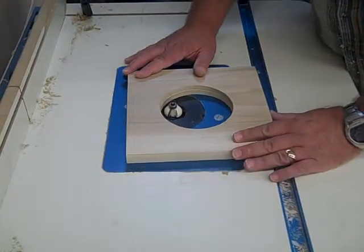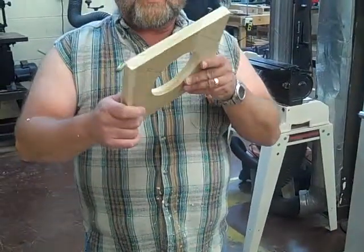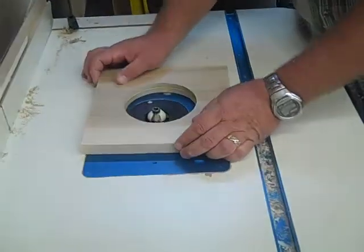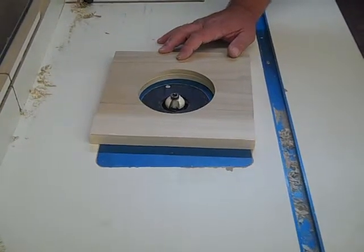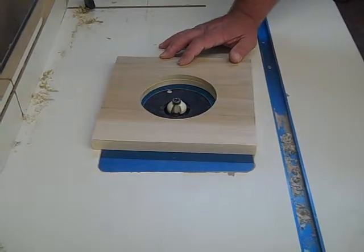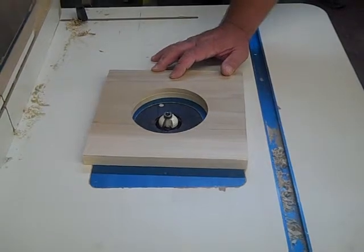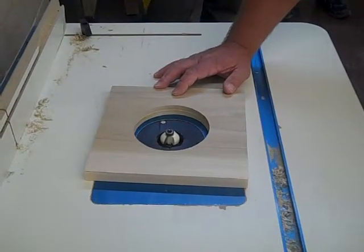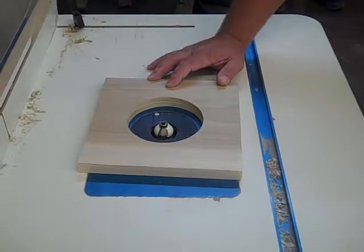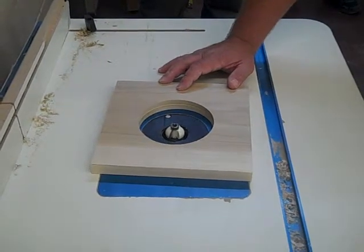Make sure you keep the board down flat on the table. You can see on the fence right there where people haven't paid attention — it broke off. If the inside is really rough, you should sand that a little bit ahead of time. When you're going around, do one pass and try to just skim the edge a little bit. If you go too slow, it burns the wood. You've got to move fairly rapidly. You just have to feel how the bit is cutting — that will gauge how fast you go.